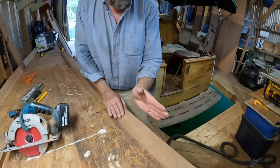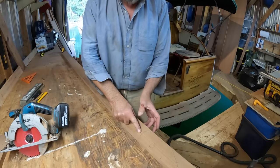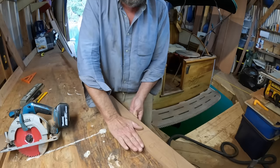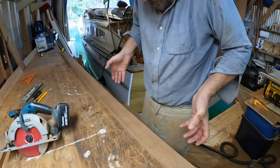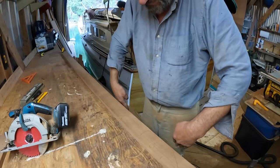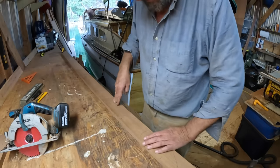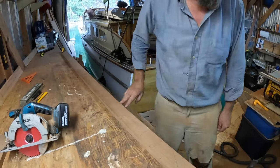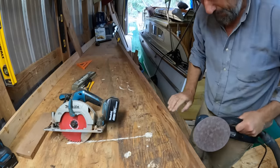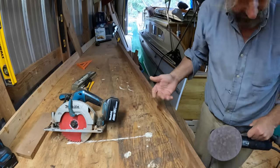I'm going to leave a little more material than the scribed line shows, and I'm going to put a very slight bevel on this edge. That's because I have to actually install the cabin side before the sill — I won't be able to slide it in any other way. So the cabin side will have to be attached to the existing cabin side, and then the entire sill is going to have to slide in from the inside. Because it's already on a slope — because the deck is sloped — I need an equivalent slope in the mating surfaces between the sill and the cabin side. It would have been a lot easier if I'd done this when I was milling it, but hindsight, yada yada yada.